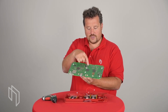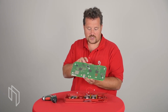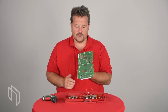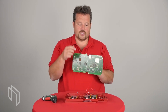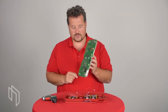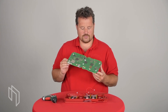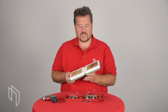Over here you have the heart of the RFID reader, which is our own custom design. Down here you have the power controls, the battery charger, and DC-DC converters needed to generate all the different voltages. And over here you have the SIM card slot. Now, one critical part of designing an RFID reader — something that kept us busy for quite some while — is the issue of self-jamming.